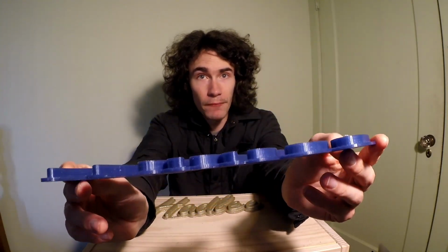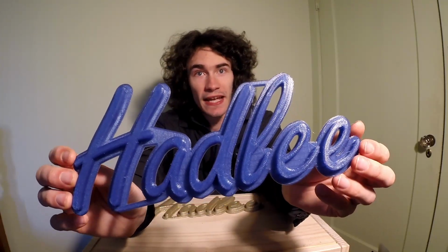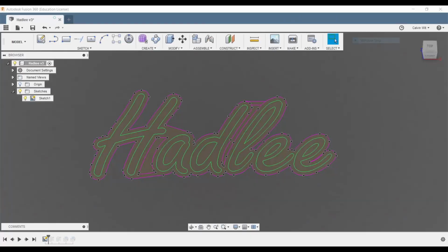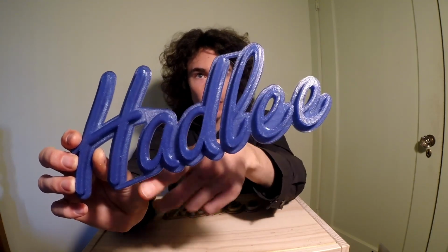What I did is I just found a script that my friend liked in Fusion 360 and typed it out. Then I decided to put a little bit of a base around the letters because it gives it a cool effect. And to do that, I just exploded the text and then I enlarged it by about 1/8 of an inch. And then I also drew in a couple of spots, some lines to join everything together. It's not perfect, but being that this didn't have a rectangular background or anything like that, it worked fine, and I kind of like the see-through effect of it anyways.